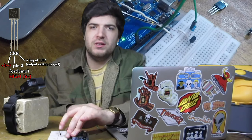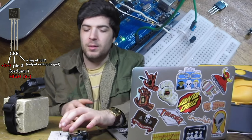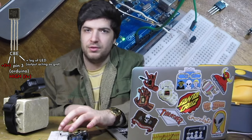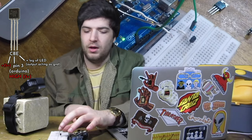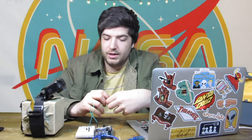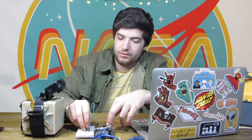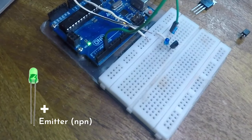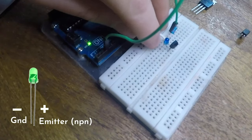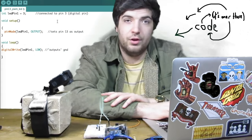The base gets 5 volts and is controlled by a digital pin, but it only gets a tiny amount of current — so I'm going to put a resistor there. BJTs are current-controlled, which means they need current going to the base, but only a really small amount. You'll burn them out if you give them a lot of current, so put a resistor there — maybe 220 ohms. The emitter usually goes to ground, the negative terminal of a battery, but it can also function as the input for something.